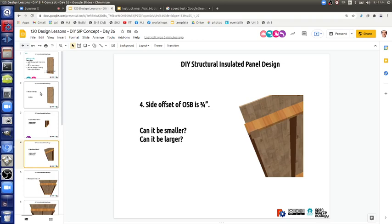And we're allowing for that mess up. Say two panels maybe have a little gap and you don't want to fix it. Say you get a 1/4 inch gap. Well, you can keep building up to 1.5 inaccuracy before the wall wouldn't fit in a 16x32. So 1/8 inch times 8 panels or 7 seams, that's like 1 inch. So we're definitely allowed 1/8 off. 1/4 times 7 is 1 3/4. So if we were wrong by 1/4 everywhere, the house would be 1/4 over 32 feet. So kind of think about it.